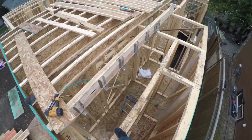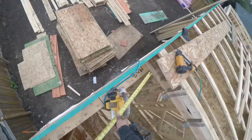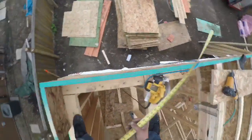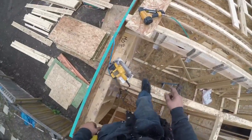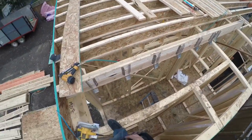And there's all the hangers on. Now I'll check what my joists are going to be. From here to here I'm 54 inches, but I want the joists to be 12 inches longer than that, so I'll make them 66. So I'll cut 7 at 66.